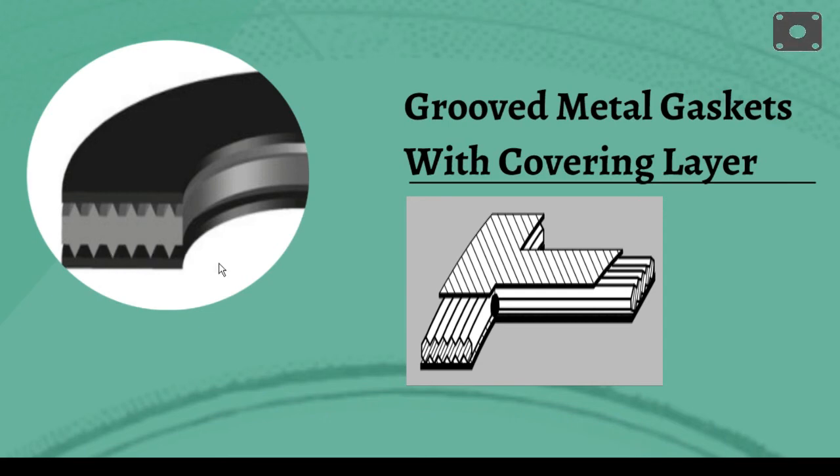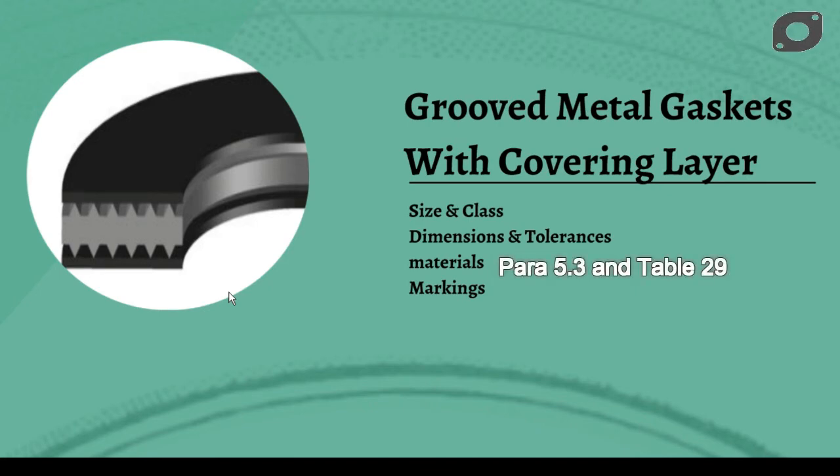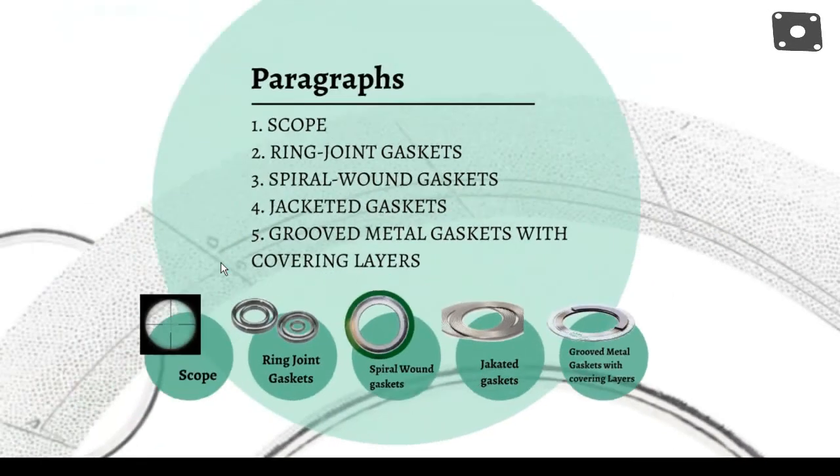ASME B16.20 specifies the size and class requirements, dimensions, and tolerances through its various tables. The construction, welding and centering ring requirements are also detailed in paragraph 5.2 and Tables 26 to 28 of the standard B16.20. Material requirements for the covering, core, and the centering ring, along with the color code, are detailed in para 5.3 and Table 29 of the standard B16.20. Marking requirements for easy identification along with suitable examples are provided in Section 5.4 and Table 30 of the standard Metallic Gasket for Pipe Flanges, that is B16.20. So, in a nutshell.